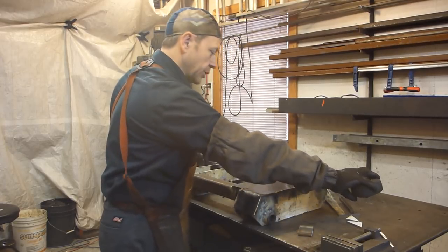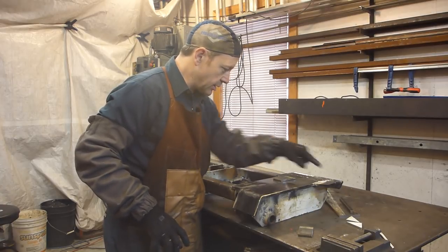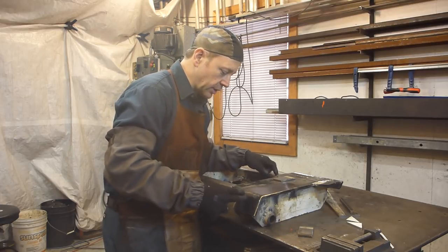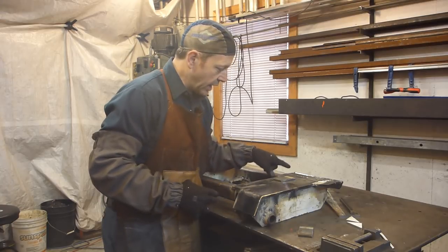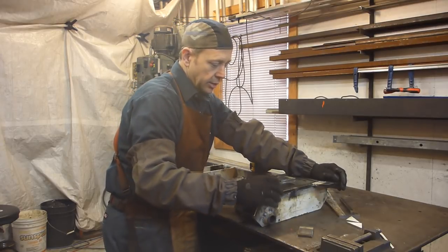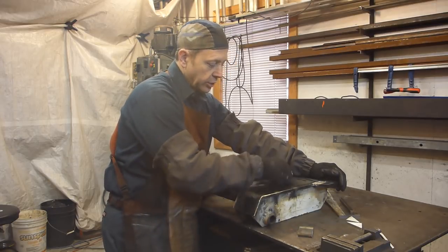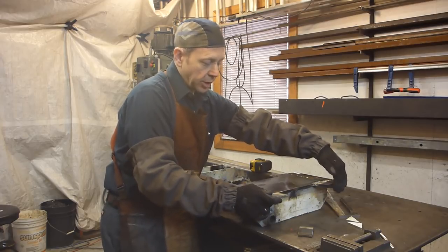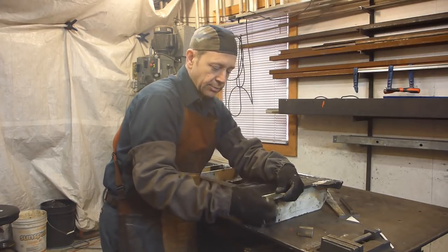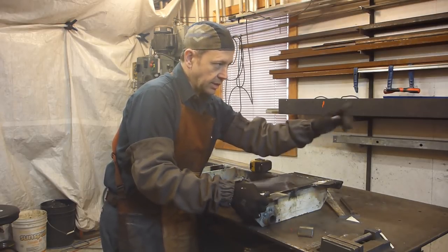Here we've got 24 at the top, but since this is an addition that we took off from the other side, this part was here just to make sure that the pin and the loader arm are not in the same position. We had to remove this and put it there so we don't have any support at the bottom, and the quick attach latch is made to have some support at the top and the bottom so it's not square, so we have to add those tabs to make sure that it can be supported at the top and bottom. And we've prepared those gussets to make sure that I don't bend that small tab, and this way this and this part will be supported by the side of the bucket.